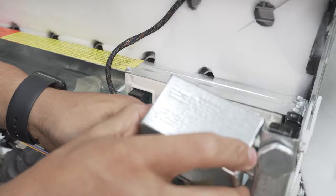While we're here, I'm going to point out you've got four adjustable feet on the bottom of this model. If you took it out of the box, GE in particular secures their dishwasher to a crate, so these feet were actually securing the dishwasher to the crate. You need to reinstall these feet so you can adjust the unit — they're not just packing feet, they're the feet you'll use to level the dishwasher. I like to make sure I have enough room to reach them, thread them in, and then we'll be ready to stand the dishwasher up.